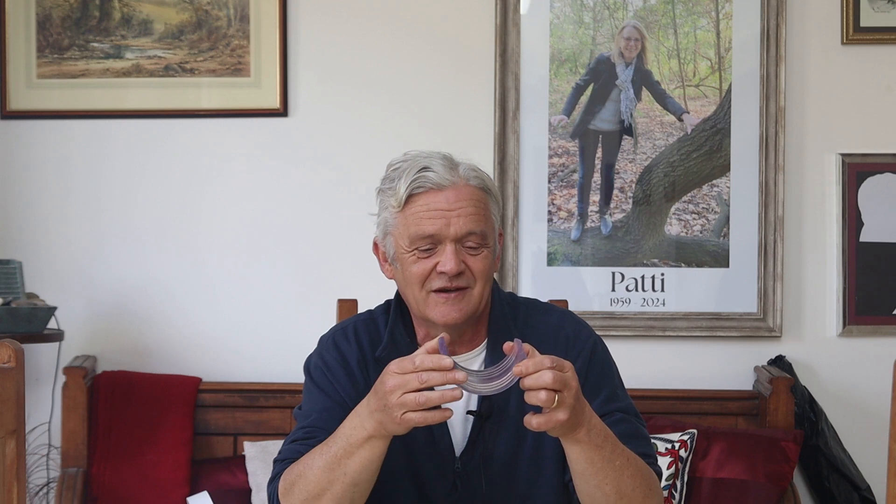I've scraped it with a knife — you can sand it, but it has a slightly diminished effect, because knife scraping is what cabinet makers do when they want to give a beautiful finish to wood, and that blade scraping on this does the same thing. It doesn't leave as many scars, but perhaps two coats if you actually sand it. I prefer the knife scraping. The extra coat of resin and the curing of it really brings out the transparency.